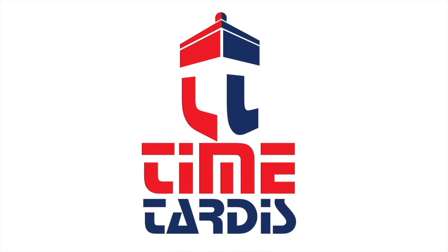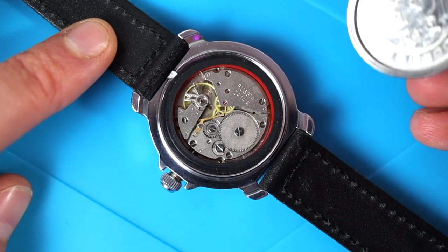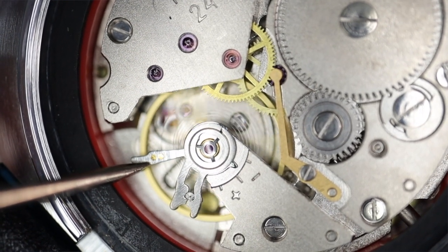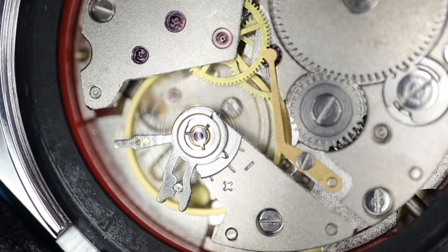Well, that is not actually bad — I'm really surprised, and also a bit annoyed! When you pay for a mechanical watch for only 45 pounds I wanted to tinker with it. Plus 3 or 4 seconds a day is pretty good, but can I improve it? If your Komandirskie is running too fast or too slow, it's really simple to regulate. Unscrew the case back and there's the movement. On top of the balance wheel you can see a little lever hovering over a plus or minus sign. With a small screwdriver, move the lever slightly toward minus if running fast, or toward plus if running slow. After a couple of minutes settling on the timegrapher I got it down to plus one second a day.